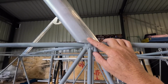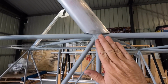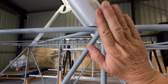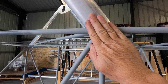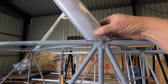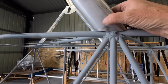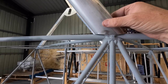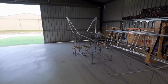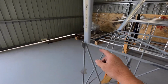I think I'll do it like mounting a cowl on an RC model. Tape some aluminium on here and drill the hole so I can flex it up, put the leg on. Should go back down right where the hole is. Pin prick the hole. And I've got some of those 3D jigs just to get the hole on centre. One bolt in there, AN3 I think. Yeah, AN3 bolts on all 4.